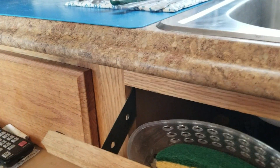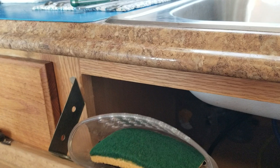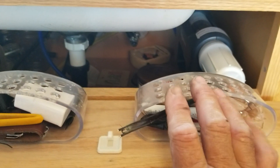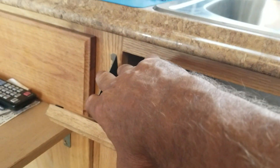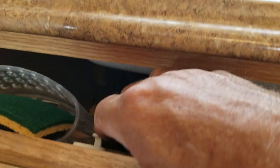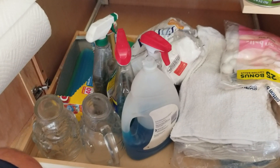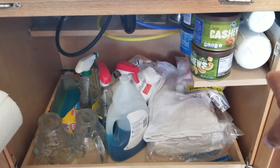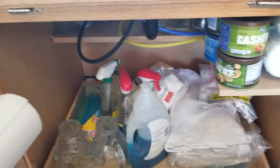I made a little metal latch out of scrap metal — it springs to pull out so I can lower this down and get into it. You can see my filtration system inside there, easy to access through the plumbing. I got these little baskets at the 99-cent store — they had suction cups for the shower, I took those off, put screws in, and now I have three little storage units plus two key hooks to hang keys out of sight. I moved the drawer down to the base as a pull-out, put paper towels on the inside of that door, and added a shelf on the side for the filtration system.